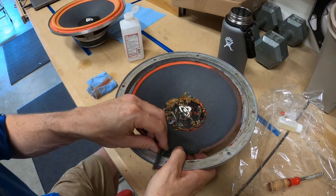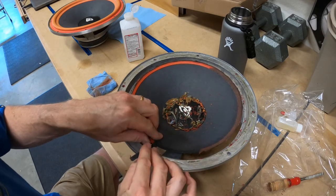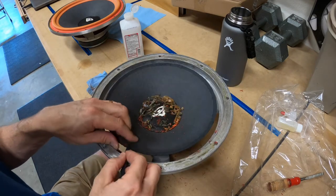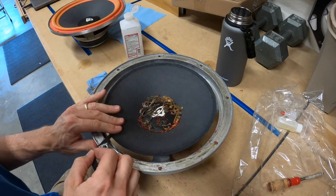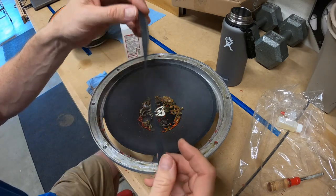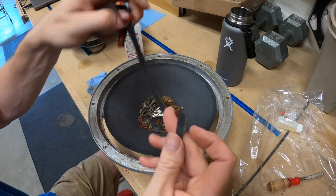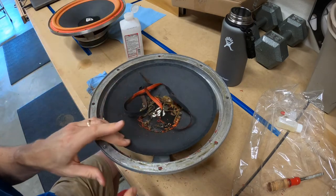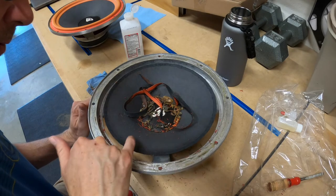The camera shuts off when it wants to — I'm a little annoyed. Basically what I was doing is just shaving it off with this quarter-inch chisel, getting these fine shavings of old glue and crud. That's the best way to do it. You're barely taking off any paper — there's a line but it's not a lip. Definitely the way to go. My hands are actually kind of tired.